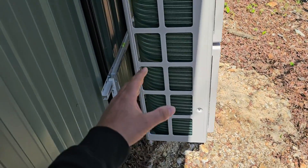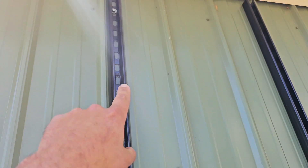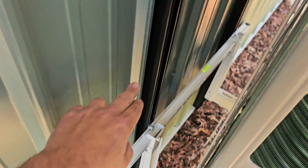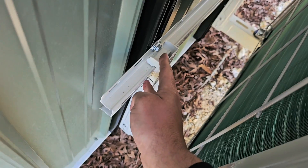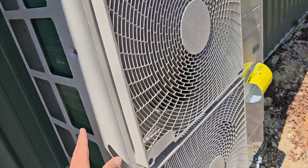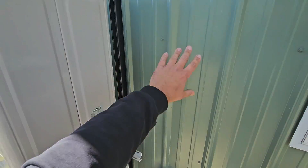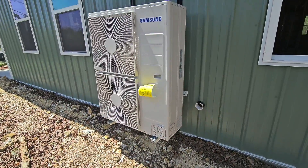Here's the outdoor unit mounted on the wall mount bracket, and that bracket is connected to two pieces of unistrut. We're using several bolts — four bolts connected to four joists inside for each piece of unistrut — and cone nuts, or spring nuts, to connect the bracket that holds the outdoor unit to the unistrut. I love this way of mounting wall mount brackets to a metal exterior wall. There's where the line sets will be. The disconnect is probably going to be somewhere right here, far enough away from the unit so we have full access and it passes the electrical inspection.